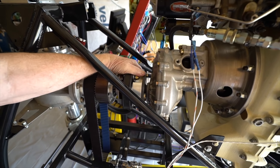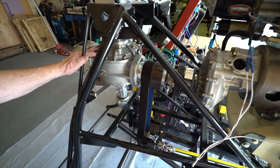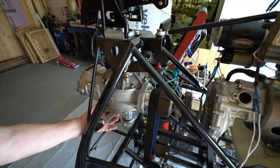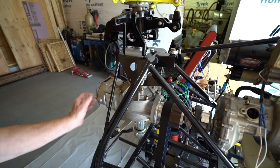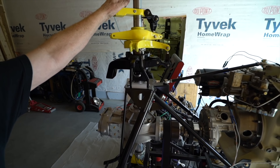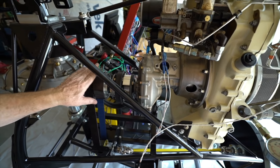The clutch starts transmitting power through a three-to-one reduction through a coupling. We have a sprag clutch here which only goes one way — so if you had an engine problem and the engine died, the rotor system will still keep on going. There's also tail rotor drive into the gearbox. This is actually a sprint car rear end made by Speedway Automotive, modified to work for their needs. They make the brackets that mount to the frame and the anti-rotation brackets. The quick-change gear set on the back allows you to adjust the RPM to whatever you need. We get 520 RPM out of this rotor system for this particular helicopter, and right off the back of the engine we get 6,000 RPM.